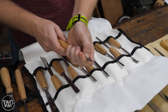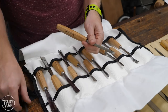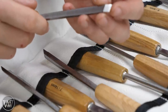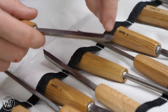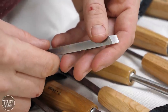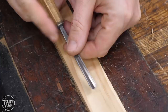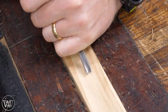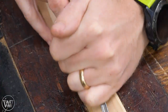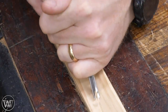The other one you might want to think about getting right off the bat is a skew for chip carving — these are very useful, but a V-tool you use all the time. So let's take all these tips off and see what these can actually do. Right off the bat, they feel sharp. You can tell they've been rough ground, but the very tip is actually polished. I'm guessing they ran them through a wheel strop to get them nice and sharp. This is my V-tool from Pfeil — one of my favorites. Let me show you what sharp should look like — you should be able to get these perfect little spirals with very little effort.